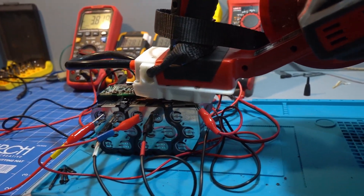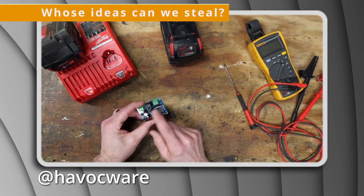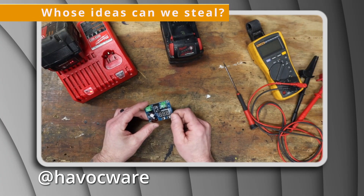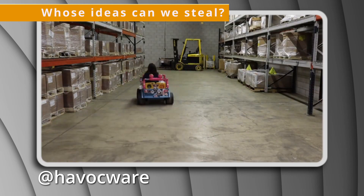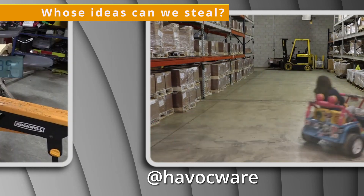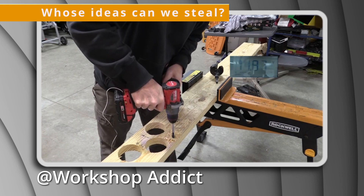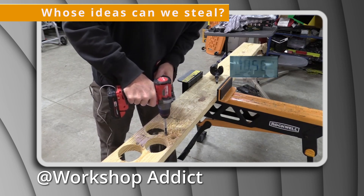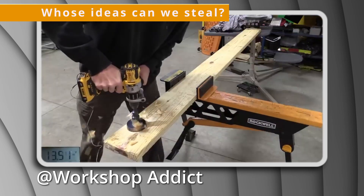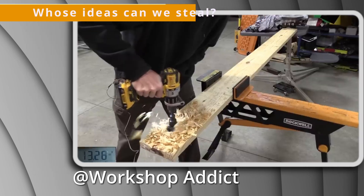So we're going to look at how far Milwaukee discharges its batteries and try to figure out why they do it. I was unable to find any information about Milwaukee M18 low voltage cutoff. All I got was various people doing DIY mods, generally saying 15 volt cutoff, which is 3 volts per cell and a fairly safe value. Workshop Addict measured voltage under load for Milwaukee and saw voltages as low as 10.5 volts with what seems to be chattering as the power cuts in and out rapidly. In his DeWalt tests we see voltages as low as 12.5 volts, or 2.5 volts per cell.